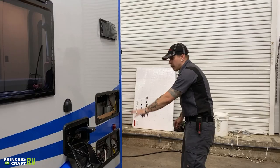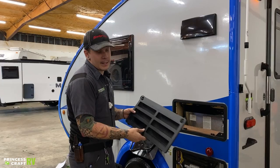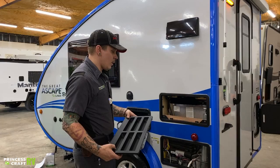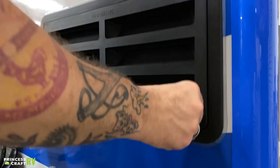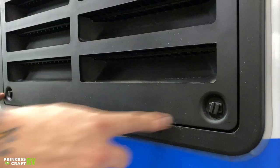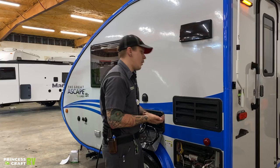Refrigerator panel here — we have your vent panels removed. Let's start out again with the notion that we are going to go ahead and further screen these in to keep those mud daubers and flying insects from nesting in there. That's number one — keep those insects out. Other than that, you're going to give this a visual inspection a couple of times a year, make sure nothing's gotten in. When it comes to putting these vents on, we're going to line the tabs up on the top, seat the square holes on the bottom, and once we are fully flushed, we can go ahead and give these a little turn. That's going to keep them locked in. You don't want one of these blowing off when you're going down the road.